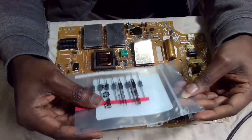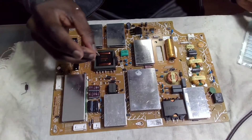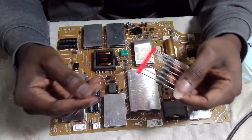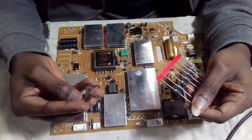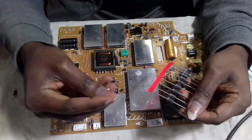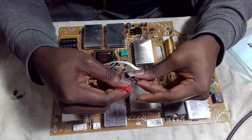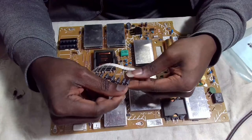I had to buy replacement diodes — I didn't have any on hand, so after two days I got them. I purchased them from DigiKey. The original part was the SB5150. They are no longer being manufactured under that brand, so after some research I found the SR515, which has the same specifications according to the data sheets.